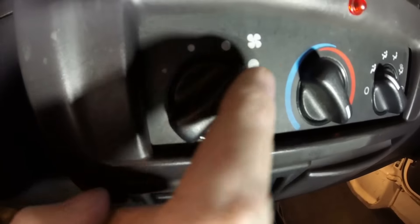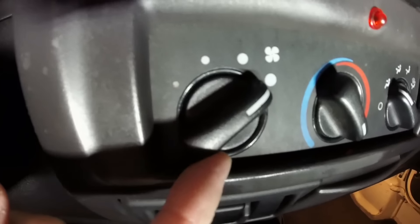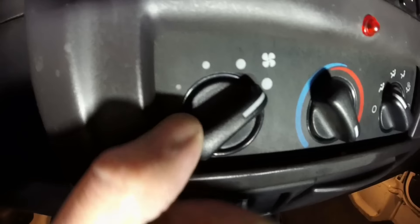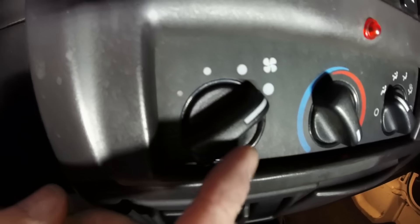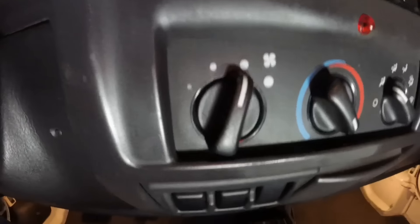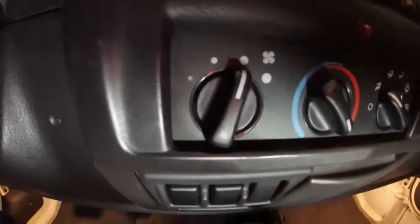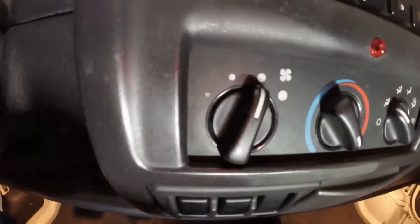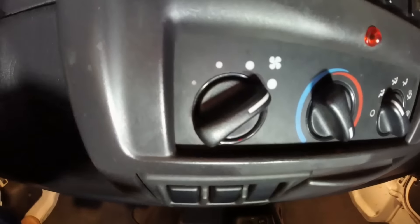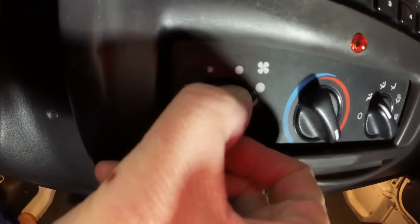See, it's a weird contact on number four. I can turn it on, watch this — turn it off like that. The contacts in this switch are the problem. It's not the blower, because that would last a lot longer until the blower overheated and shut down. But it's this switch — I turn it to four, it stops, nudge it, it comes on.